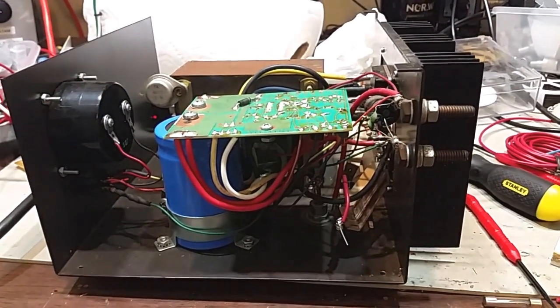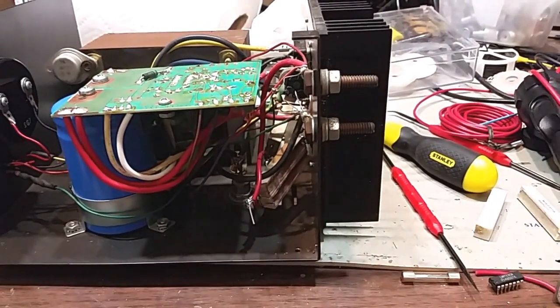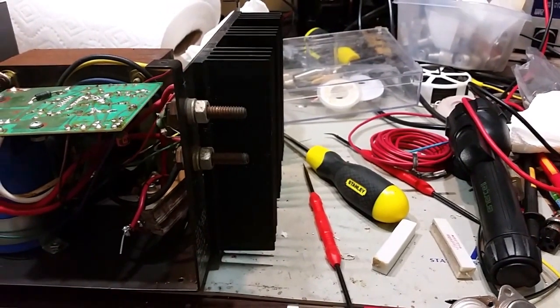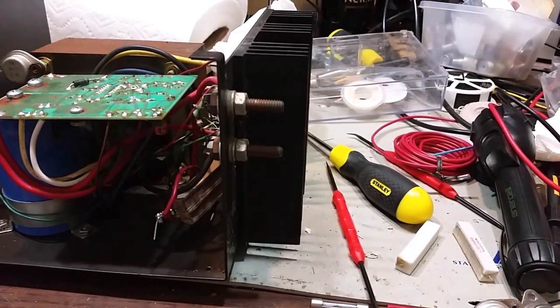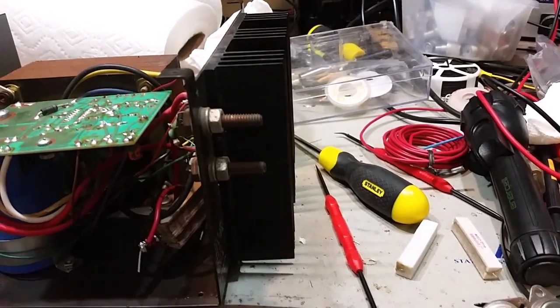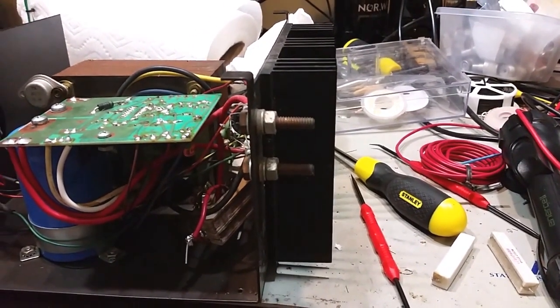There is something to be said for having an external crowbar. I like to put a fuse in line, then have an external crowbar, and have a separate external fuse on the load side — the 13.8-volt side — that will blow when the external crowbar goes off. A lot of the crowbars I build use SCRs rated maybe 10 amps, built with the expectation that an upstream fuse is going to blow within a few seconds, not operate for days as a continuous short.